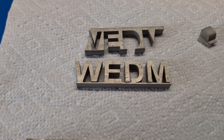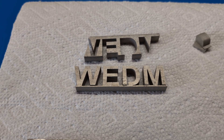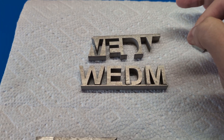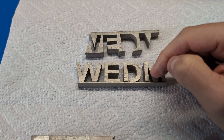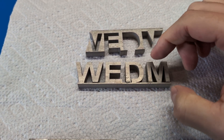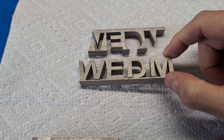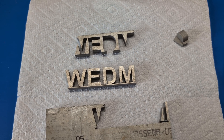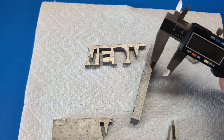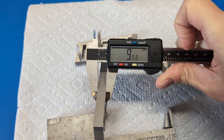That piece turned out pretty good. Overall it took about a little over an hour — probably closer to an hour and 45 minutes to cut. Tough to say because I had to do the pause and there were a couple of things that went wrong. I wasn't cutting as fast as I would have liked — the flushing nozzle wasn't working very well and I kept breaking wire, so I really dialed down the speed. I was probably doing on average seven millimeters per minute cutting this, which is three-eighths inch aluminum — about 9.5 millimeters.